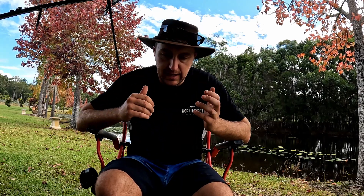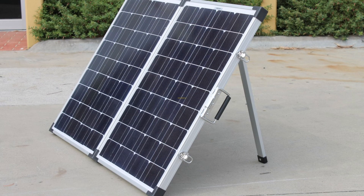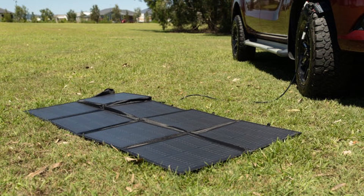Taking a step back: 12 volt batteries obviously need charging. There are a few ways you can do that. The most common one is solar panels. You can have solar panels on the roof of the caravan, solar panels that fold out and you just plug in, or solar blankets. Each has their own special uses — solar blankets are very light and flexible, portable solar panels are quite large and bulky but a bit more efficient, and fixed roof panels are great but you can't angle them toward the sun.